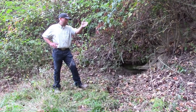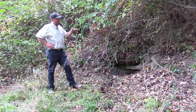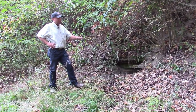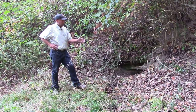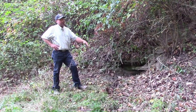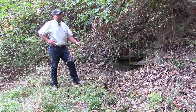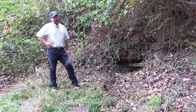There's about a hundred feet of collection along this cliff base. The cliff base was eight foot tall when we started. We put a perforated pipe at the bottom, filled it with gravel, and then pushed dirt up against the cliff. It has since settled, and so that's why the water's coming out of here. So what we're going to do is dig along these wet spots until we hit the old gravel — there's 57 gravel in there, it should be eight foot thick. Once we clean that out and get down to that gravel, this water will then go back to free-flowing down to our perforated pipe and get into our collection system.